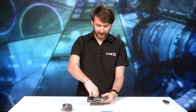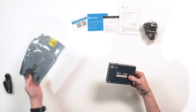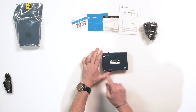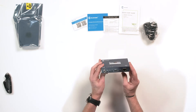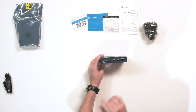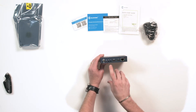Anti-static bag — very, very nice. Do not rub your feet on the carpet and then decide to touch one of these, because you will no longer have a KiloView E2. There we have it — nice blue, labeled E2, so we know we have the right item. H.264 HDMI encoder. Taking a closer look, you have your ethernet, which is also Power over Ethernet, HDMI in, HDMI loop out, and a 3.5mm audio input in case you do not want embedded audio from your HDMI.